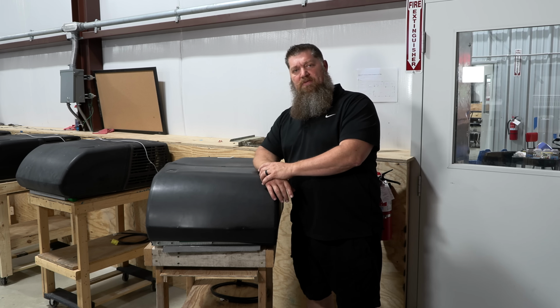Now, the coils themselves, they're a little bit thicker than aluminum foil, so we've got to be delicate with those. And that's where the brush comes in. So what I want to do, if I have the brush, is to take it and slowly begin to get the dirt off. Find which side is dirty, and that's the side you want to clean.